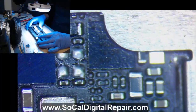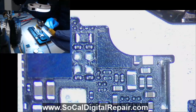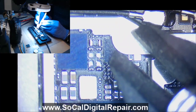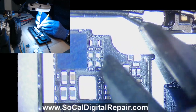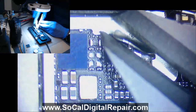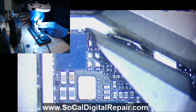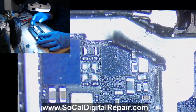Now TriStar is right here. It's in a tough spot because of the shield, so using a wire cutter type tool we have to give ourselves some room. The way I do it, I gently set the blade and try to bend it upwards. I recently messed up these tips so it's a little harder right now. There you go — bent it up and then I put it across like this. Chop it off. Let me snip off a little more — you've got to be real careful, it's easy to chip or crack one of these components. Don't ask how I know.